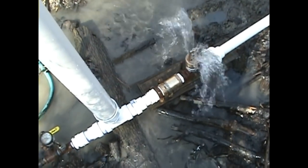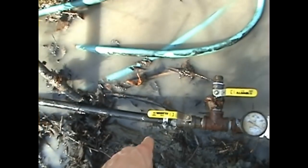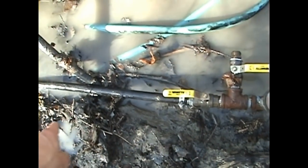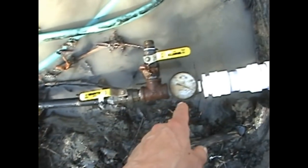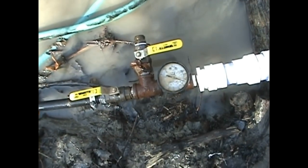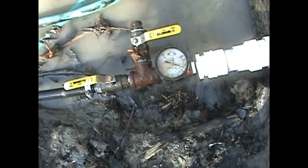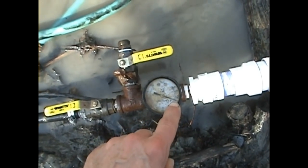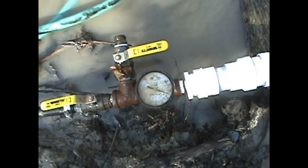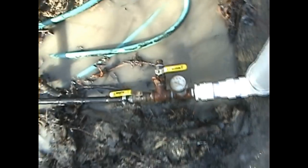She's been running about 10, maybe 15 minutes, and we're recharging. I actually had to drain the entire delivery line — I had to disconnect it, and I don't have a separate valve when the pump comes out. So we're recharging the entire delivery line, which is about 800 feet long and climbs about 65 or 70 vertical feet. At the moment we're pushing just close to 25 PSI, so that means we're just about full on the line. Soon we'll go up and do some volume delivery testing.